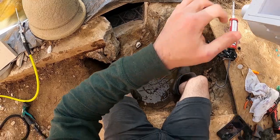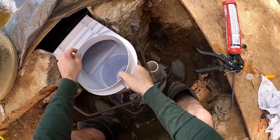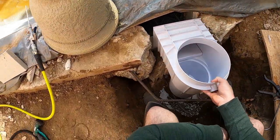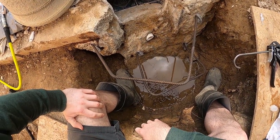Quick check with the rebar in place to confirm I can still get the skimmer in and out — yes, looks good. The rebar is in for this skimmer. The skimmers are set in the holes, fully plumbed, tied in place with rebar tie wire, but I still have some play to make final adjustments and get them level before the pour.